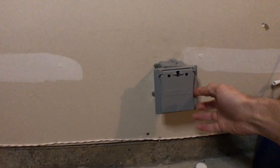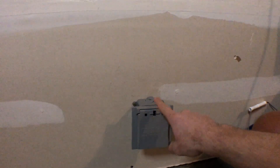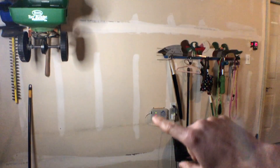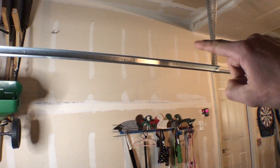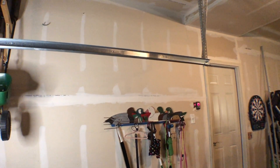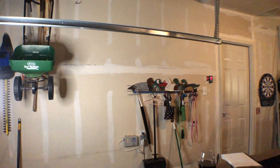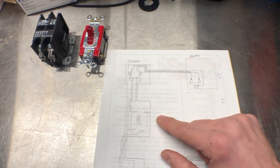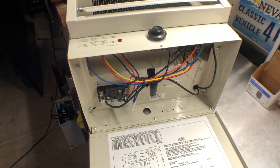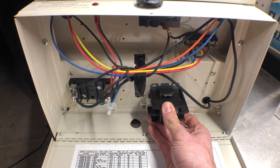This is my 30-amp plug I have for an RV - we're going to tap into this plug and run some conduit off the top, straight up the wall all the way to the top, turn to the right, and mount the heater just to the left of the door. These ceilings are really high, so that's another reason I want to put a switch in line - so I don't have to reach really high up there to shut it off. Instead of running this contactor in its own box, we're going to put our contactor inside here - there's enough room for another electrical component.